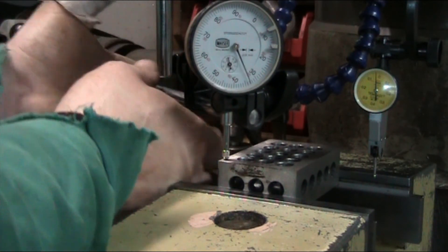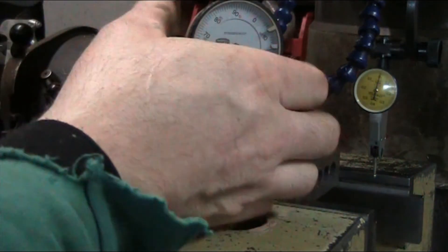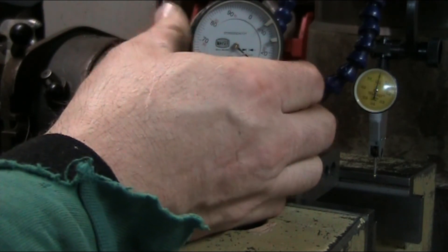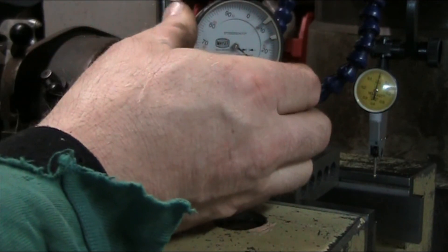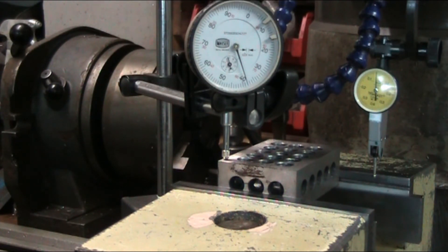I'm not going to zero the dial — I'll just set it to the next increment. Let's get it at thirty-one hundredths of a millimeter as our point of reference. So with the average shop gronk, we're at thirty-one, re-tighten, and it goes up to thirty-eight. So there's seven hundredths of a millimeter in movement without putting any downward pressure, without tapping the workpiece down onto the parallels.